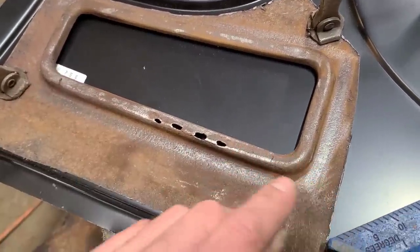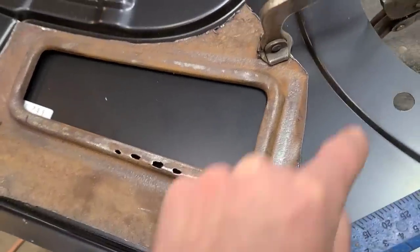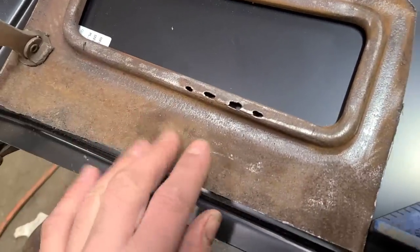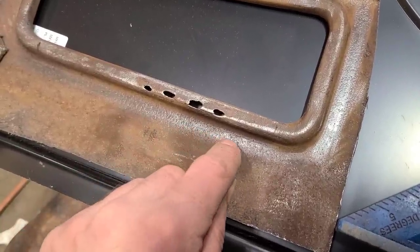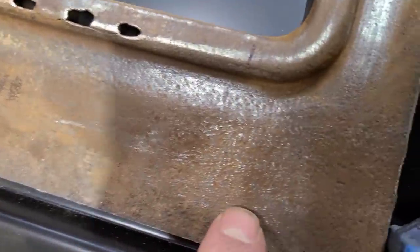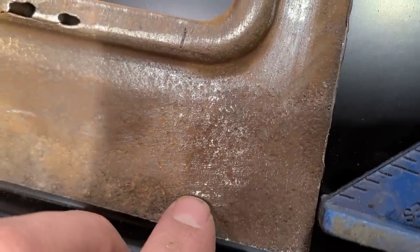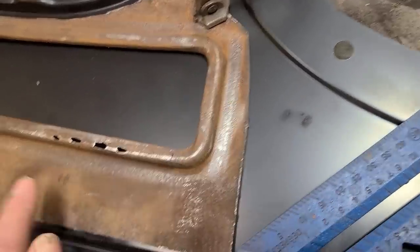So now, I don't want to section it in the way I've got it cut out. Like I said, I only cut it out that way so that I have a point of reference for grafting it into here. What I'm going to do is graft in the least amount of this panel as possible. A couple of reasons for that. One, you can see it's quite pitted, not ruined. That's still very weldable, but why would we want to weld garbage when we have fresh, clean metal to work with?